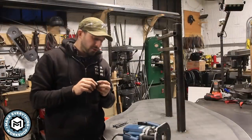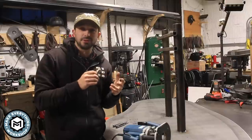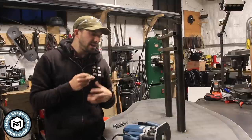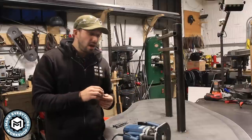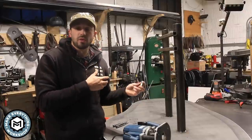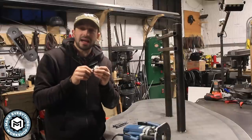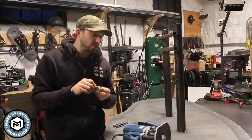That about does it for this little video. I felt it was necessary to show off a product like this because it's absolutely going to change the way I work with steel in my shop. The biggest part about fabricating is finding creative and quick ways to get really nice uniform results. Traditionally, if you wanted a round over edge on a piece of steel you would do it with a grinder, or on a milling machine you could use a corner radius mill cutter. Other bevelers like this exist — I've just never used one that performs quite like this one with the guide bushing.